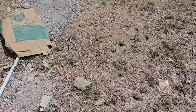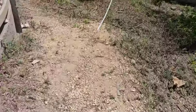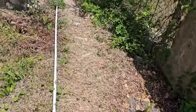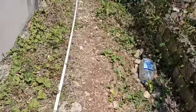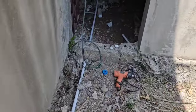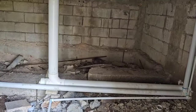This is very important — you should always do a pressure test. I've said it many times in my videos: you want to make sure these pipes are not leaking before you put them in concrete. Here in Jamaica we do a lot of concrete work, and this pipe right here is going to be underground, not on top. If you haven't watched my earlier videos, I show this process there.